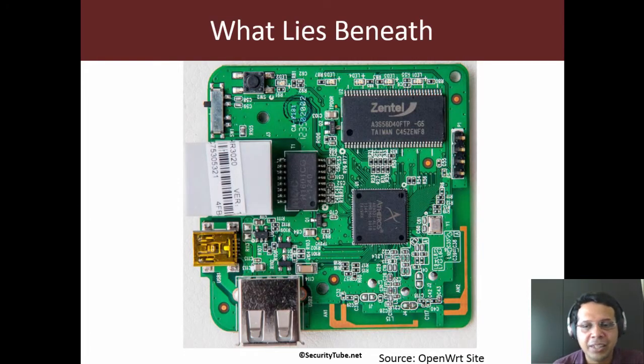Keep in mind that there is no serial interface available on the device as you can clearly see from the outside. Serial interfaces allow us to debug a lot of things happening on the box, and this is also typically the way manufacturers might test their own equipment. If you brick your device or something goes wrong during a firmware upgrade, then using the serial interface with the help of the bootloader, you might still be able to restore your device. This is why serial interfaces and JTAGs are very, very important in the world of hardware hacking.